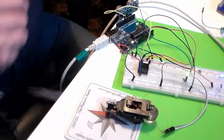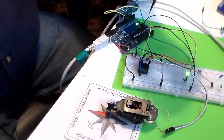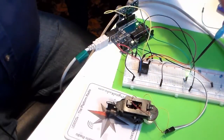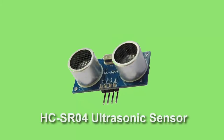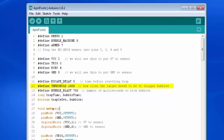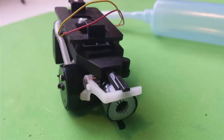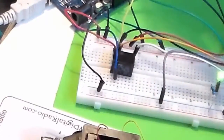You want to see the bubbles? Walking through here one more time — we've got our bubble machine over here. The green LED tells me it's armed. The blue LED will come on when the sonar detector measures how long it takes a ping to bounce back off an object and come back to the sensor. I'll use a threshold in the software to detect the presence of our target. I have it set really tight right now so that all I have to do is put my hand in front of it and it'll activate it. There's a relay in here that will put 5 volts on our little bubble machine. I'll move my hand down — and out come the bubbles! How about that?